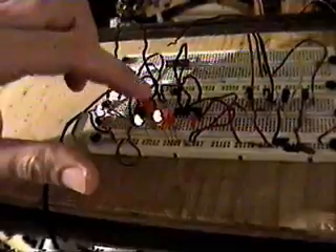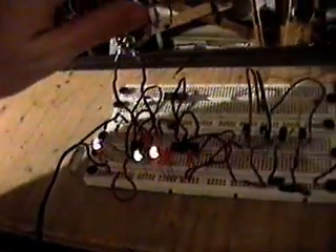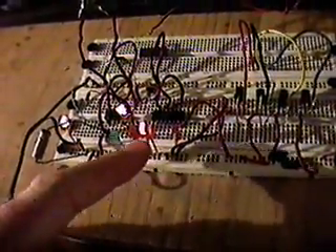These are the two outputs — it's really one output, it's a trick to make it flash two LEDs. This is connected to a CD4017 decade chip, configured right now to reset on the 4. So this one is 0 — I'm going to go 1, 2, 3, 0, 1, 2, 3, 0.